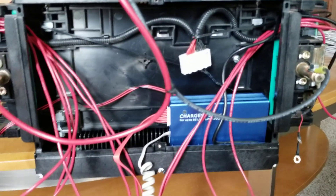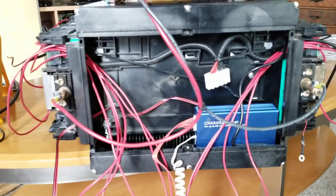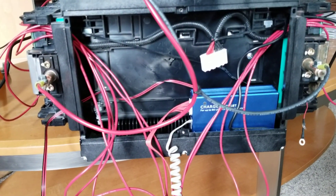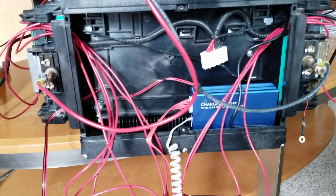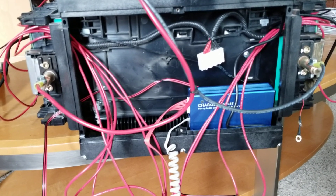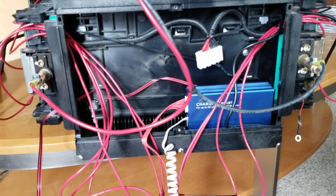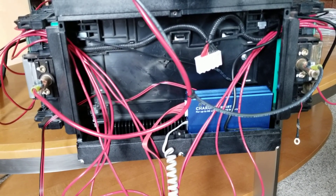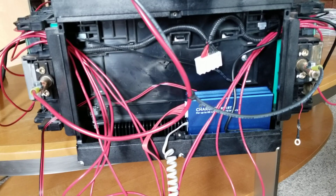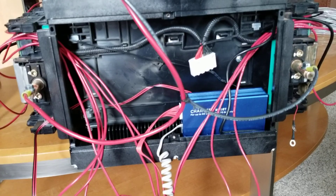The reason why I want it to balance that hard is when these batteries are discharging, a lot of amperage is flowing through them. This thing can keep up with the discharge rate and keep those cells balanced as it's discharging. A lot of the other BMSs and charger units don't have that — they have a few hundred milliamps, which just isn't going to do it. For storage it'll balance them out after a week or two, but for more use and better output capacity from your batteries, you need to go with something like this.